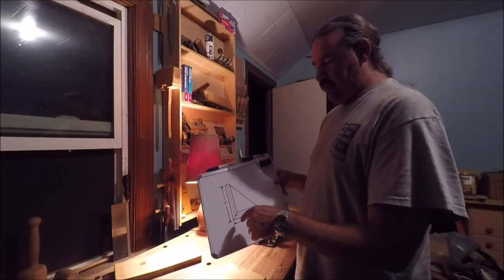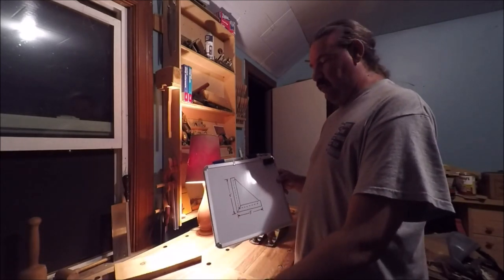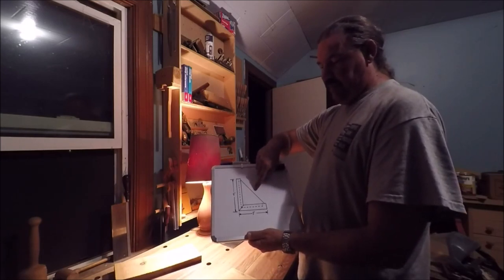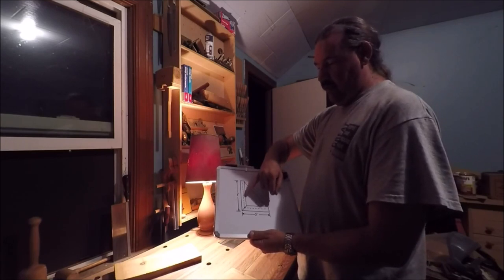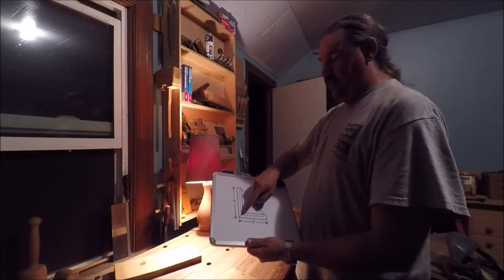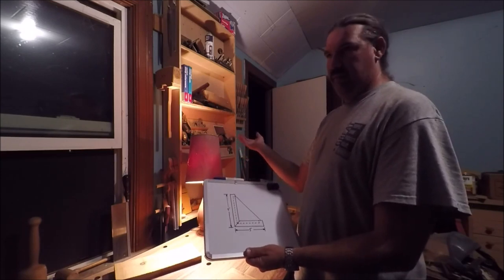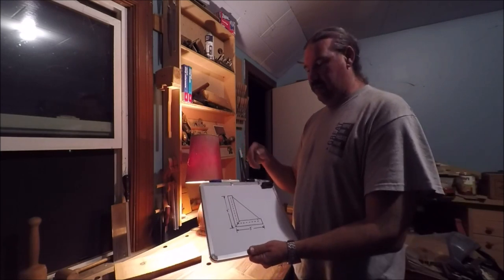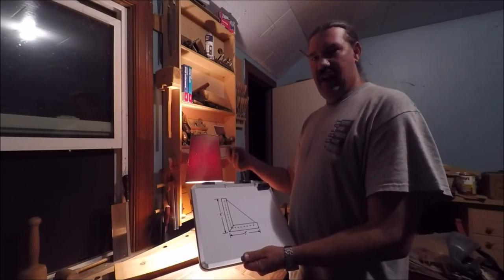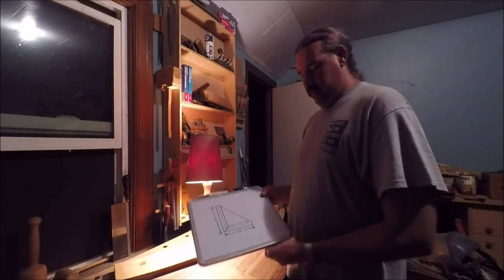It's going to be five inches wide and five inches tall. We've got some three-quarter inch wood here. I'm going to put a single gusset in the middle using a stop dado. You could use a dado cutter on the table saw and hog out a groove all the way through, but then you'd have an opening at the top you'd need to fill with putty or bondo. With a stop dado you avoid that issue and the long-grain distortion that comes with filling gaps.